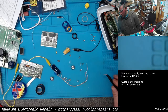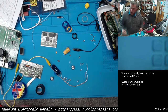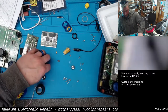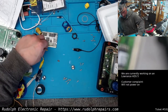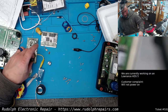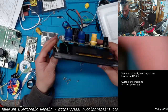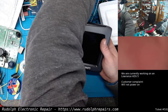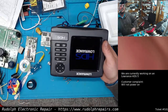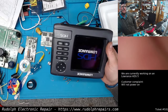That was a tricky one, but we got it done. I replaced the keypad backlight board with one I had in a parts unit - these are all the parts from that parts board. I put it back on there, and let's see what happens. Three, two... and there we go! The keypad backlight board was causing the issue.